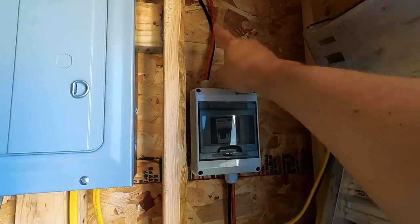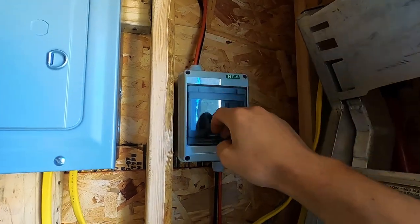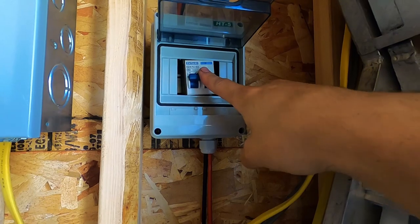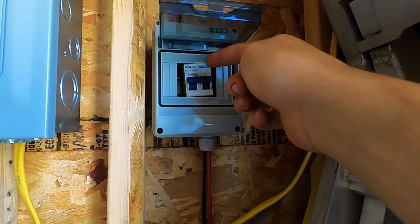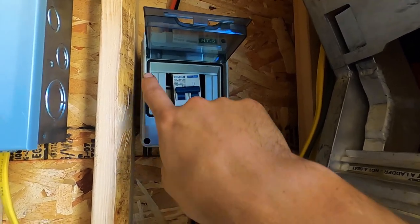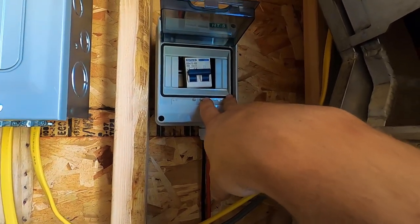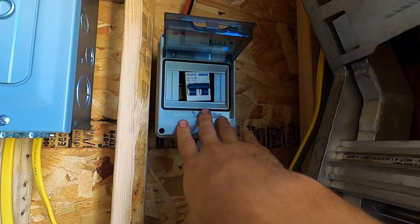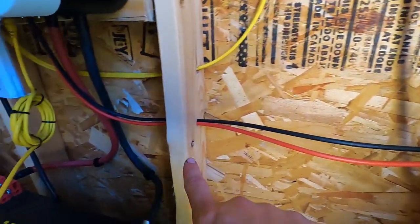From the panels, they come through the side of the shed via a little umbilical so we don't get any water in. I ran them to a DC circuit breaker here. This allows me to shut off power coming from the panels when the sun's out, so if I have to do any work I can just turn this off. Even though I have inline fuses up on the panels themselves, so if there's any overvoltage or a short it'll blow that fuse, if a short makes it down into these wires this breaker will trip before it ever reaches the inverter. Always protect anything electronic — one fault in one area can turn into many faults and be very expensive. It's just a switch I purchased on Amazon, and it brings the power in from the panels and then out to the inverter.